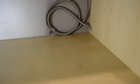Have some paper towels or some rags with you, because you have so many nuts and so many connections, you may end up having some leaks, like in this case. If it's leaking like that, it may be that something has to be tied and stuff like that. But don't get too frustrated, because if you put too much pressure with a wrench, you may end up damaging the threads, because now we have a metallic part and a plastic part, and sometimes they just give up. So go ahead and test it again.